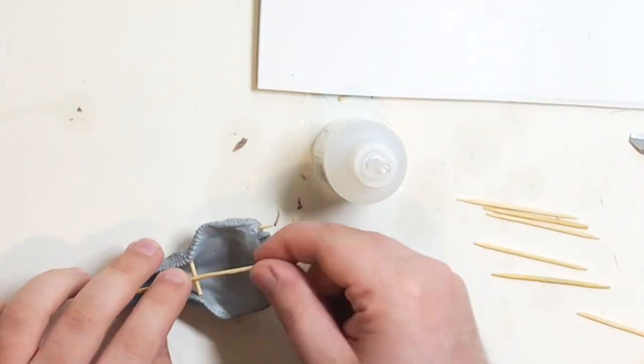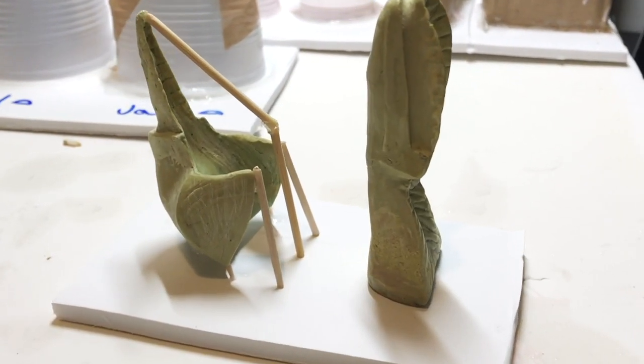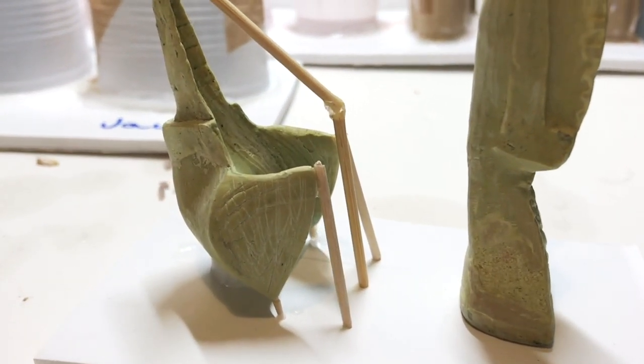For this next part, I will still be doing some block moulds, but this is a little bit more complicated. With these cocktail sticks I am gluing onto the model, I'm actually creating some bleeder holes. Bleeder holes actually help air escape from the mould when casting, and that is very important, because it is very easy to get air bubbles into your casts. Having some holes in the mould actually helps prevent that problem. I made some bleeder holes onto the inside of the mouth too — it looks weird, but trust me, it helps a lot.